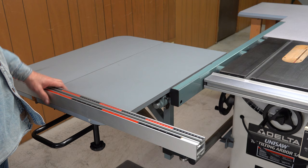Okay, so number 15 is going to be a little tougher to explain, but this is a 1/8 inch pin. Although these are all a little bent and beat up from all the years of use. This one gets smaller, and this one gets smaller yet. When you cut a piece of wood and the end piece is left here, typically it's chattering on the edge of the blade, teetering, making noise and wanting to be thrown at you. If you hold it on this end, because it gets smaller at that end and bigger at this end, it unloads the pressure on the blade. So instantly you can just touch this side and move it right past the blade without it touching that blade or making any problems whatsoever.